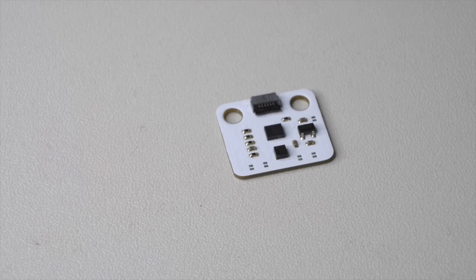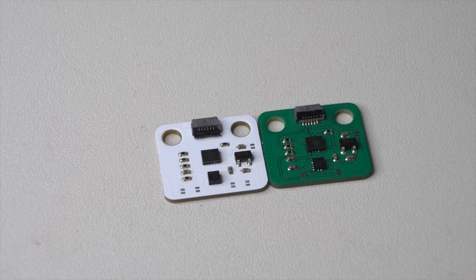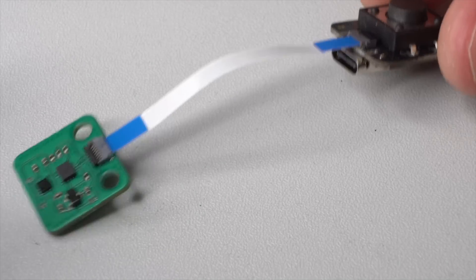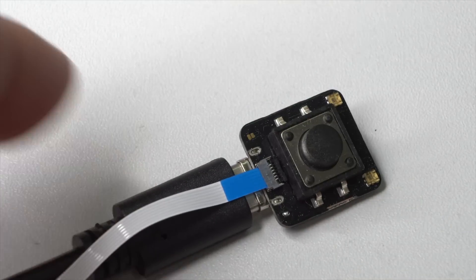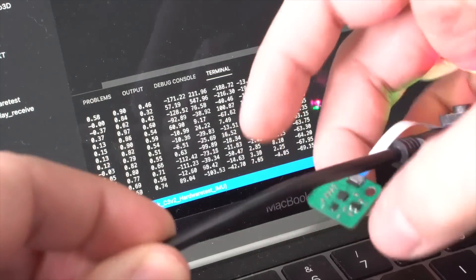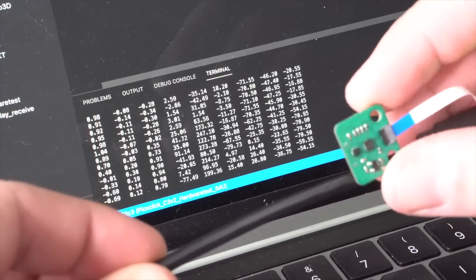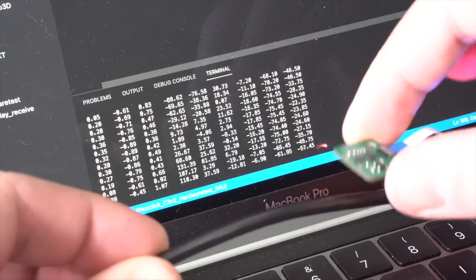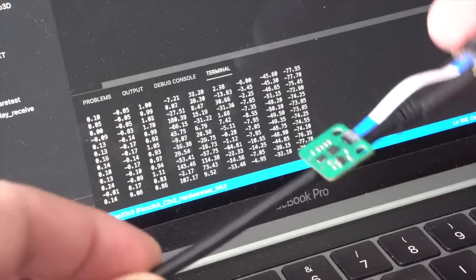Last but not least, the PicoClick can be extended with a 9 degrees of freedom board. As I made a mistake on the first design, I created a new one which solves my faults. It has an accelerometer, a gyroscope, and a magnetometer included, and can be used to track any 3-dimensional motion. Originally I designed this to control my omnidirectional robot, but that is part of the next video. As it is hard to show all the different values on a tiny OLED display, I printed them on the serial monitor. But as a little spoiler to what it can be used for, the following little clip shouldn't be missing.